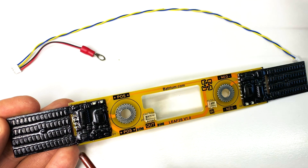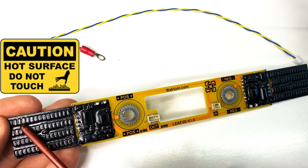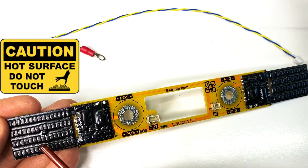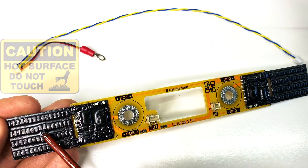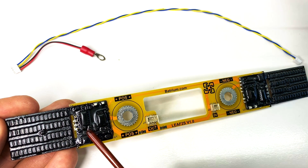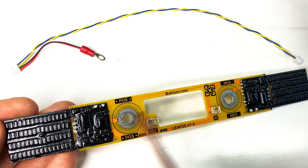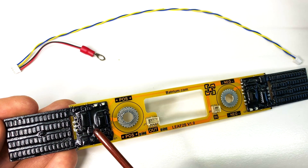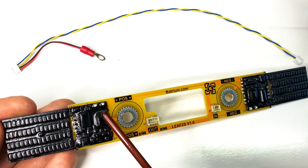Here is a close-up on your cell monitor. It is divided into two sections. On the left you have the resistor bank and one temperature sensor — that's the area that gets hot, up to 75 degrees Celsius. On the right you have all your cell monitoring area, where communication happens, voltage is measured, and cell configuration is stored. There's another temperature sensor here that senses cell temperature.